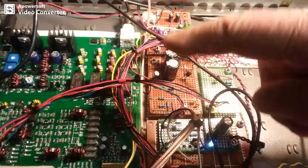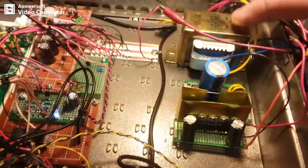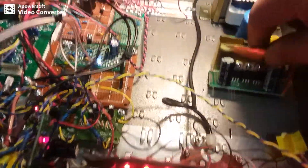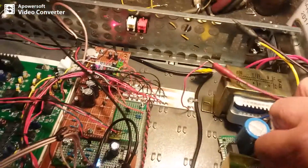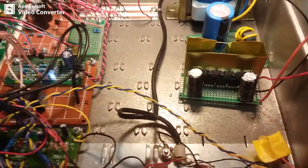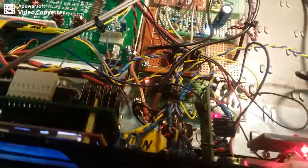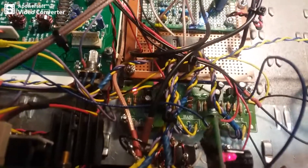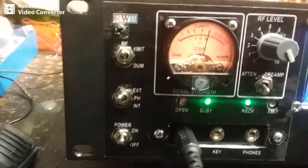I've got all my ancillary stuff lined up alongside. The power supply is fake right now, just in here for positioning purposes. There's a four or five amp transformer, the power supply bridge, and the regulator for 12 volts. Down in here is the switchover gear. That black relay is the second TR switch, which we could use if running a linear or to invoke this 15 dB receive preamp.